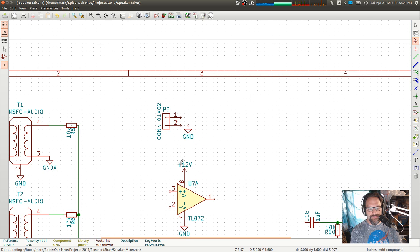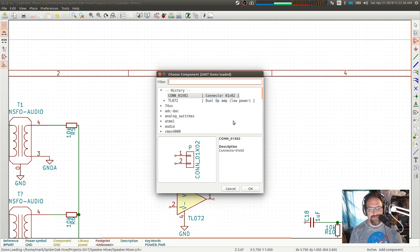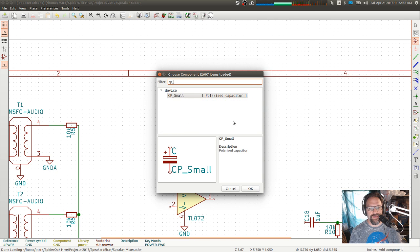All right, so there's my power. Let's get a power connector on here. That one. And, wait, what? No. There we go. Flip it. And then we're going to throw some filtering on here, because filter all the things, bypass all the things. That is a 1 microfarad, so that's probably a 1206 surface mount. I will want to put an electrolytic on here as well. I don't think we have any electrolytics on the board yet.